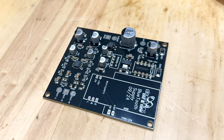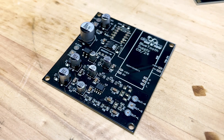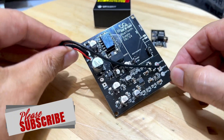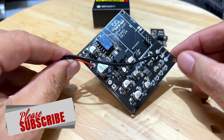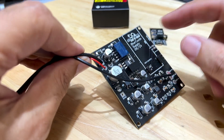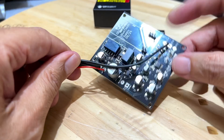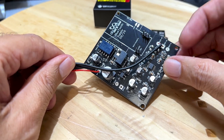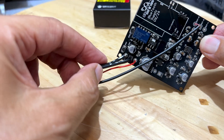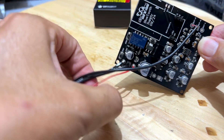I didn't have one component tombstone, rip off, slip off, or pop off — it just works. My wife doesn't know about it, which is the most amazing part. The only components I had to solder after the SMD stovetop experience were the DC converter and the relay. I've also soldered the wires — this is an audio cable, just ground and one phase since this is a mono system. I've got the 6.3 volts, the chassis ground, and the red wire coming from the magic eye signal.